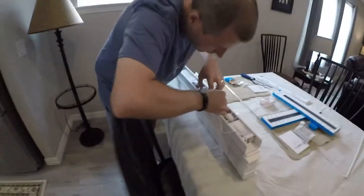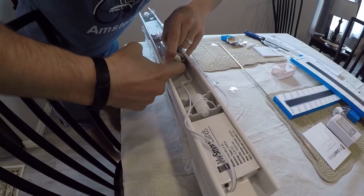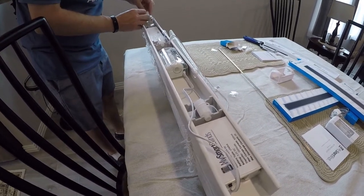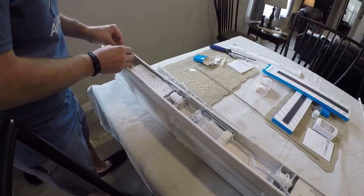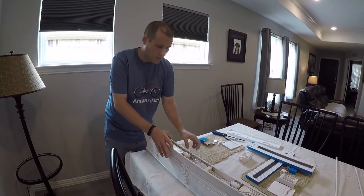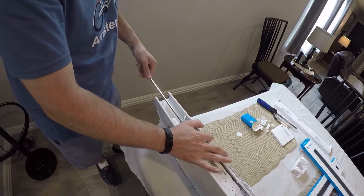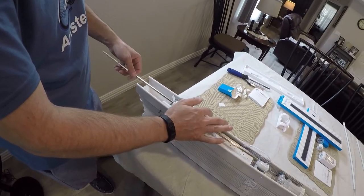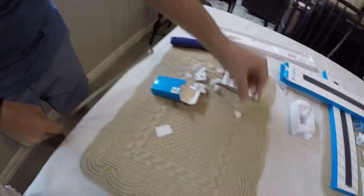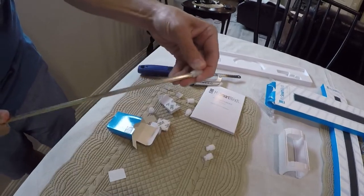Then I'm going to plug in my power to the battery. Now the only thing left for me to do is to put the rod back in. When you put the rod back in, the one thing you want to make sure of is that you put it in so the rod isn't going to be moving anywhere. So you have all these different stoppers right here. You want one that's tight on there and allows it to slide on the rod but not rotate on its own.